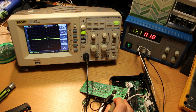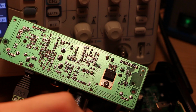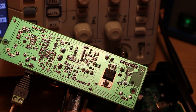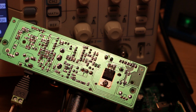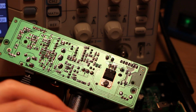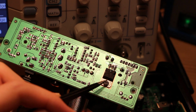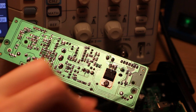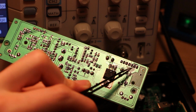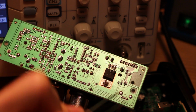What's the level like? Check. That's pretty low. It's probably line level-ish. All right, so the current mystery is, why does this thing even have so much circuitry on it? The other board handles all the radio reception. We do have the 9-volt linear regulator over here. This connector, aside from the power going back and forth, just has line-level audio coming in.